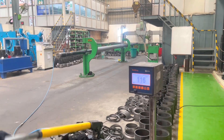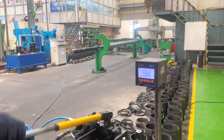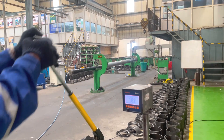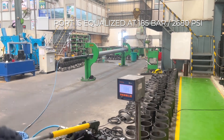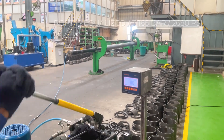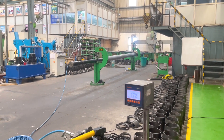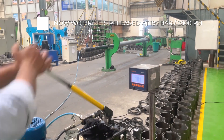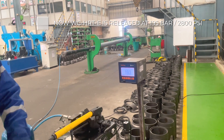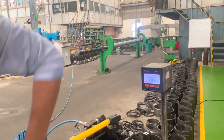The next step is to equalize the port of ESYBS to release HRTE from the hookup. Now we are again increasing pressure in the hookup. At 185 bar or 2680 PSI, the port is equalized. Without waiting, we are increasing pressure to release HRTE at around 195 bar or 2800 PSI. The running tool is released and we can see a 10 bar drop after releasing the running tool.